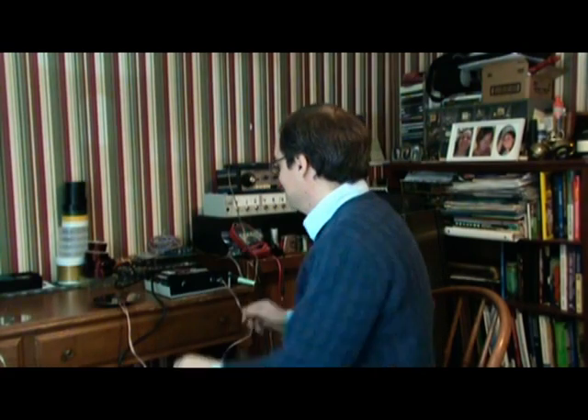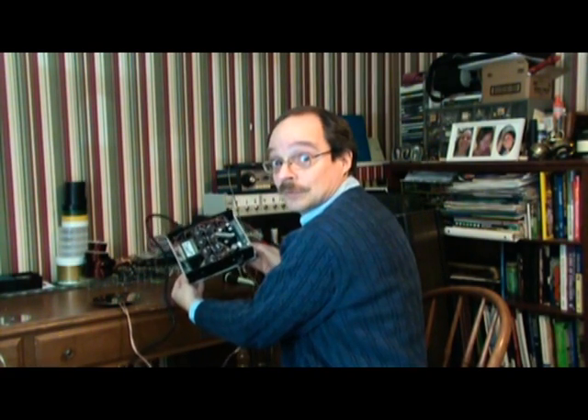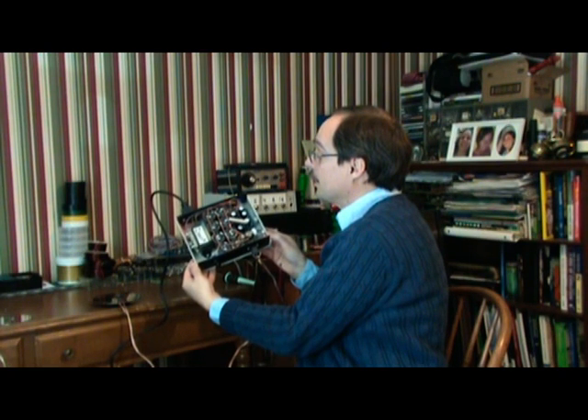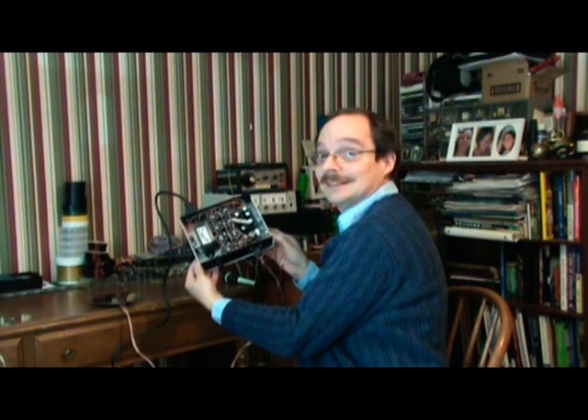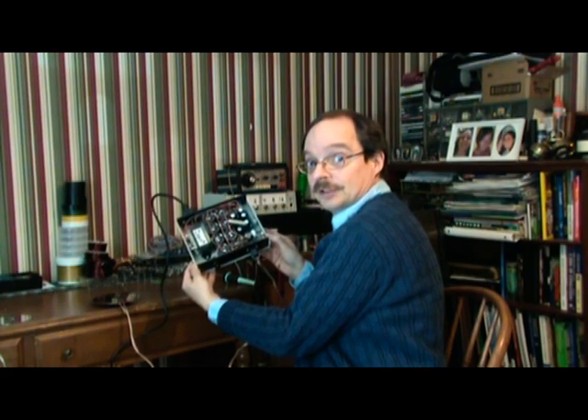And then this is the current model. It has a power transformer in it, 390 microfarads times 8, a voltage multiplier, and still a 100 amp SCR.